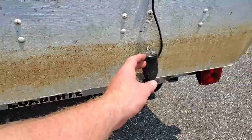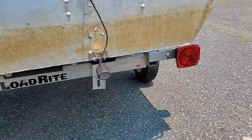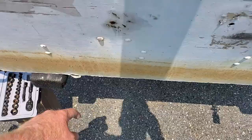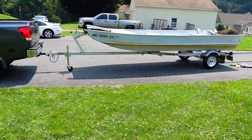I think the tipping issue was because my bunks were too close together. Off video I'm going to move them to the outside of the boat to make it a little wider — that's much more stable. You always want your bunks to overhang your boat just by a little bit, or you'll end up denting it. The corner is way stronger than the bottom of your boat. And Bob's your uncle — we got a 1980 boat on a 2022 trailer.